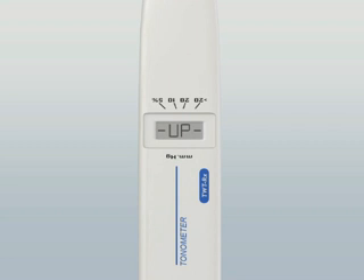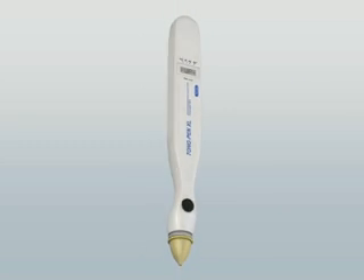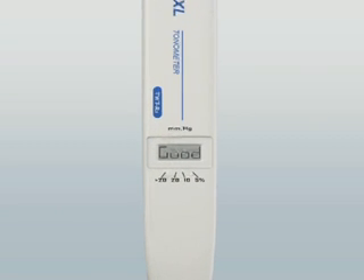This may take up to 20 seconds. 'Up' will then appear on the LCD screen. Immediately turn the probe 180 degrees so that the tip is pointing straight up. In a few seconds, you will hear another beep. If the LCD reads 'good,' the calibration was successful and you are ready to use the device. If the LCD reads 'bad,' the calibration was unsuccessful and you will need to repeat the calibration process.